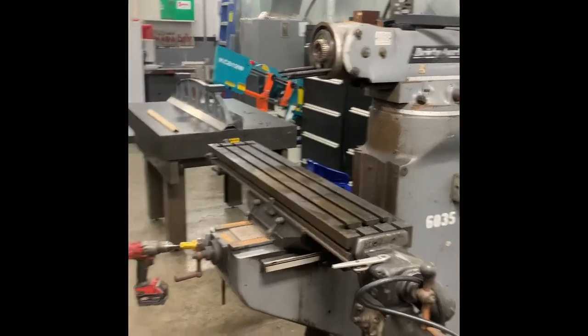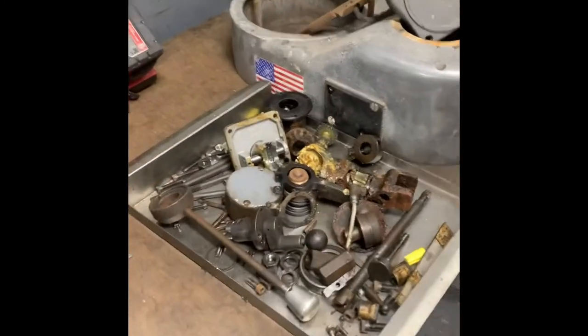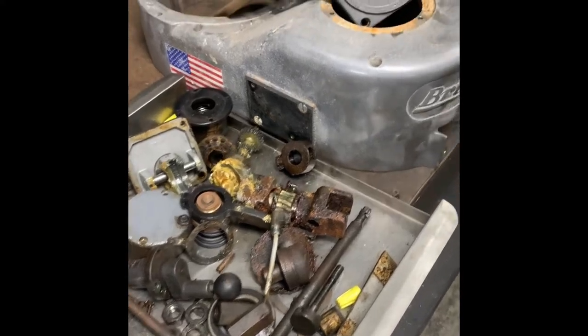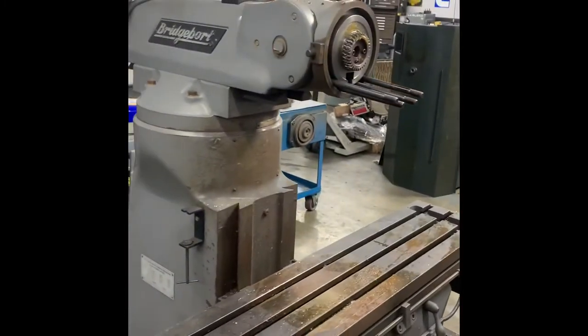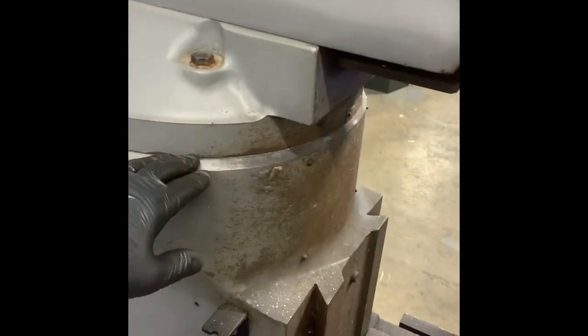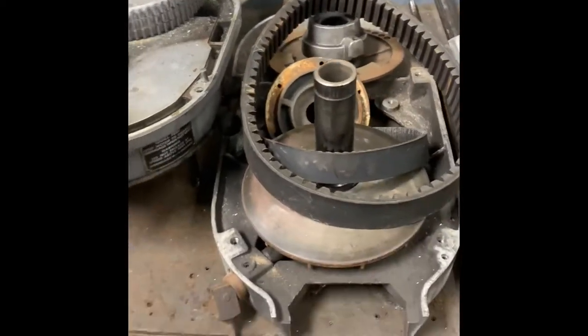So we have the head all apart down here on the bench. Typically what I do if you're going to tackle this yourself — as I strip the head, I put all the parts in a pan, all the small stuff, and take it apart in chunks. Then I'll service each piece and as I service it, I reinstall it. The first step is to strip the head all the way down, then clean the machine down to the turret. Once that part is all cleaned, I start with the lower housing, service it, then go on with the upper housing. I service it piece by piece and stack it as I go.